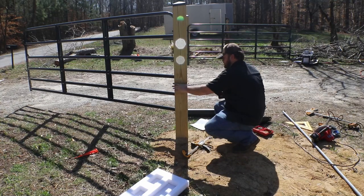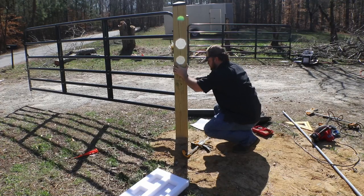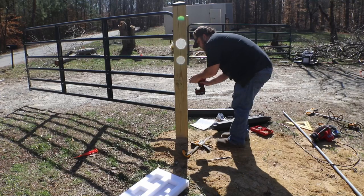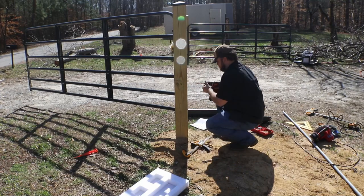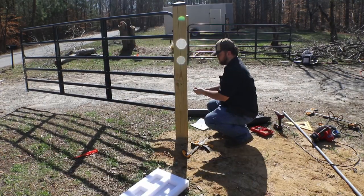All right, so here you'll see me take the drill, and I'll drill through with the longer drill bit. Like I said, it's a smaller gauge. It's not 7/16 inch diameter, and that'll allow me to center on that hole on the backside when I come in from either end with the shorter bit that is the right size at 7/16 inch.